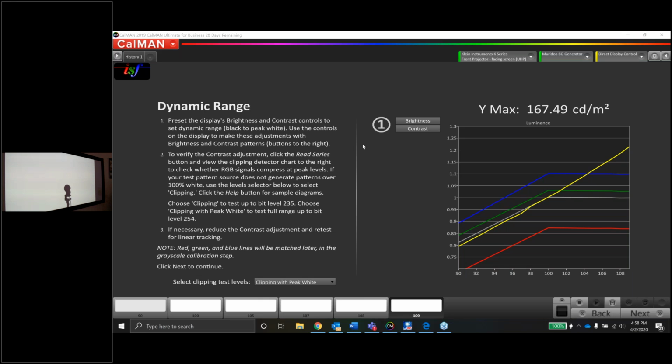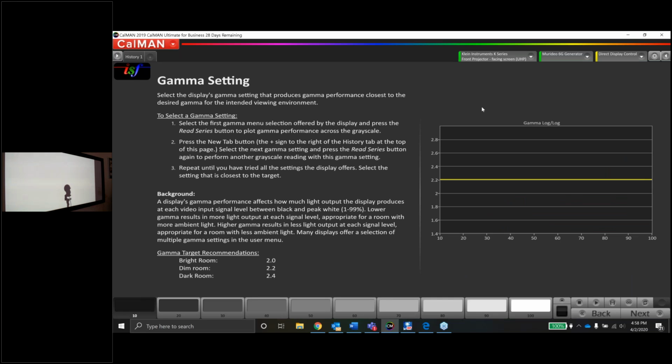And it goes the other way too. The bigger the screen, it doesn't have to be as bright to be as impactful, if that makes any sense. If we did 50 foot lamberts on a 50 foot screen, it would probably hurt to watch. But good call. Yep, you're right. At least on SDR, it's 14 foot lamberts. That's exactly right.